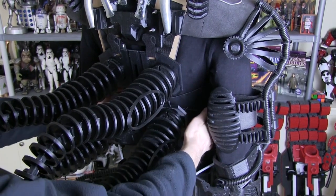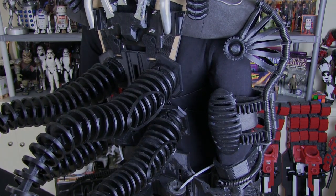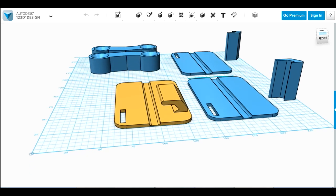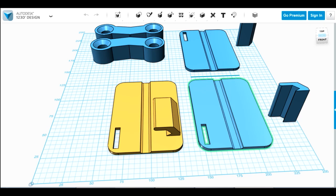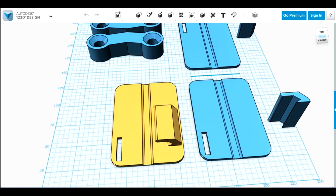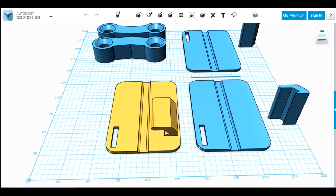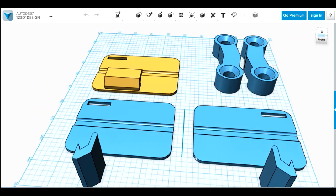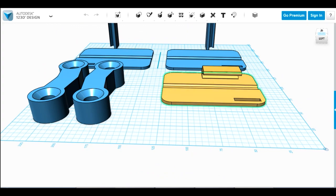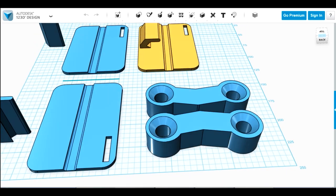The extra rib sections go in either side to meet the rib cage. They're currently elasticated around the back, so we just need to make a little bridge rib section that holds the hole onto the front of the ribs. This is the plan for the rib sections at the side: the gold plate shows both pieces together consisting of a flat plate, and the blue ones are the two pieces spread out on the bed made into opposites. There's a groove down the middle that's going to be heated and bent to match the contour of your body. The hook will be acetone welded onto the elastic hook of the front rib sections, and the hole is going to be velcroed onto the back panels. Around here we've got two actual rib pieces that will go in the spare space to the left of that gold hook part — probably only one on each side since it's under the arm, but the aim is to carry the rib cage around into the back panels.